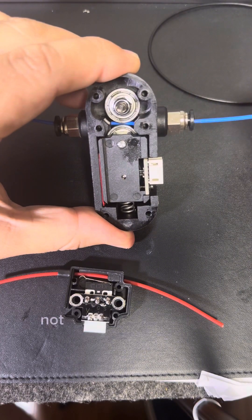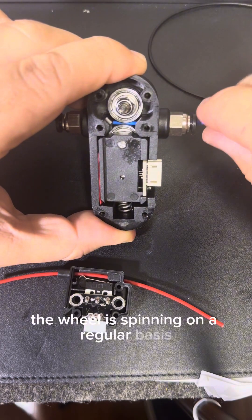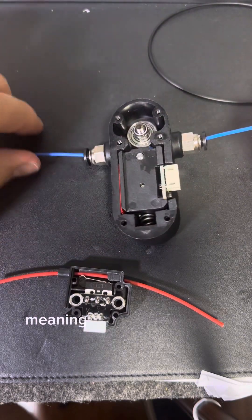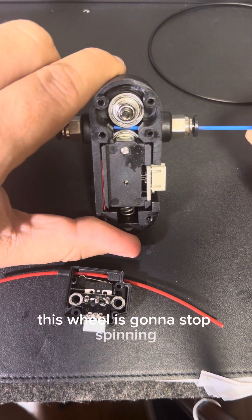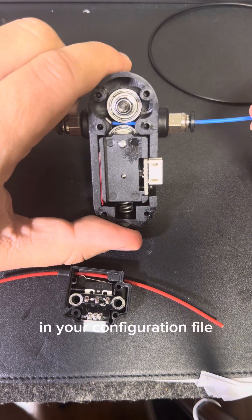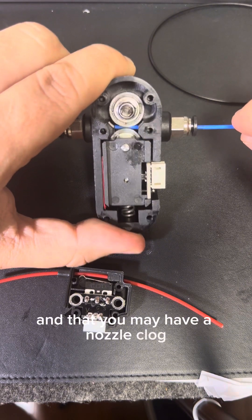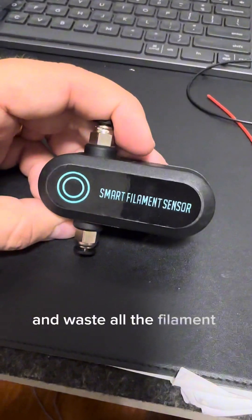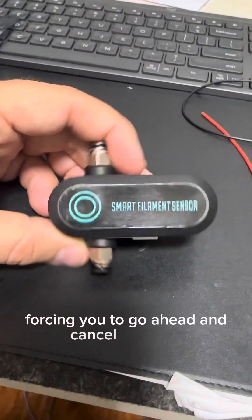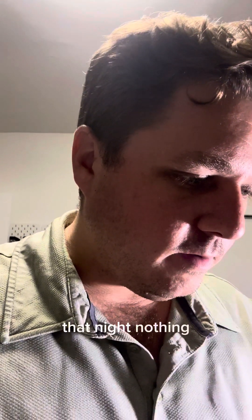This sensor is measuring not only whether or not there's filament inside, it's also measuring whether or not the wheel is spinning on a regular basis. If you get a nozzle clog — meaning the extruder is no longer able to pull any more filament through — this wheel is going to stop spinning. Depending on how you set it up in your configuration file, it could be very quick to detect there's no filament going through and that you may have a nozzle clog. It's going to stop or pause your print so you can address the issue and not waste all the filament you've already spent. Or even worse, you started a print at night excited for it to be done in the morning, just to come and find that nothing got printed that night.